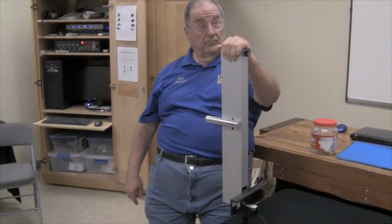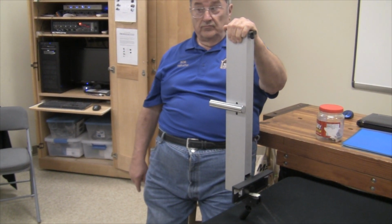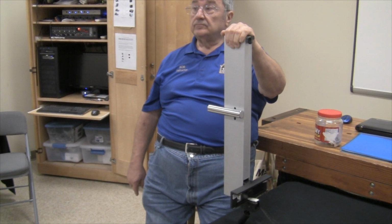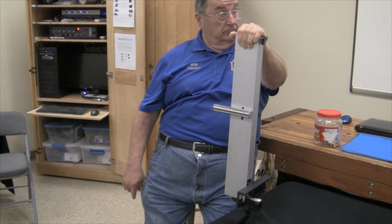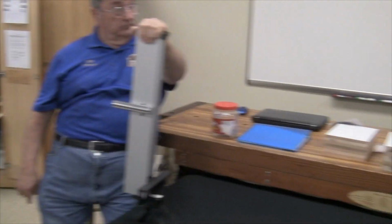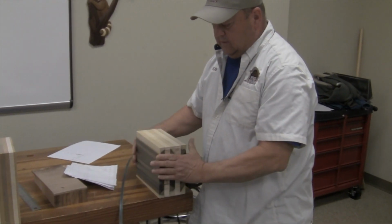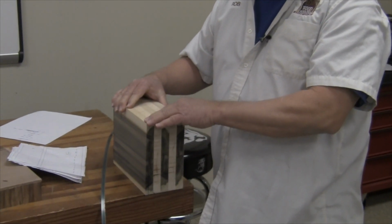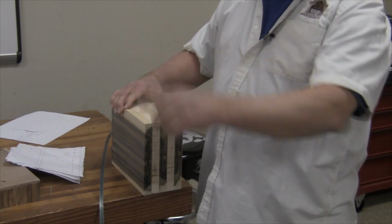We covered that. When I've got a thicker piece, like a 1/4 inch or thicker for resawing, I use the fence just like Bob does. But if I'm doing a piece like this bandsaw box, I had to cut the back off, and I'm cutting this piece off the back of it. It's easier for me to look at the line on there and just cut straight across without using the fence. And that's the purpose of that.